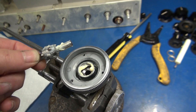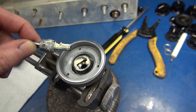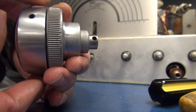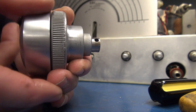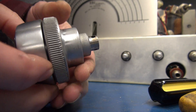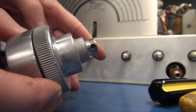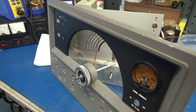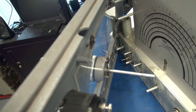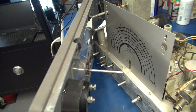I've got everything greased and the ball bearings are ready. I'm going to drop this into the raceway and get this vernier back together. The vernier drive is reassembled and it is working. The fine tuning is what usually fails on these, but this one is operating. This is the one-to-one tuning, so I need to lube this ring because that's what slides in a bearing surface in the radio. It's reassembly time — I've got the vernier working the best I can. You do have to reassemble the pointer and that quarter-inch shaft before putting the front panel back on the radio.